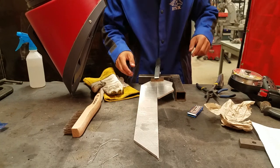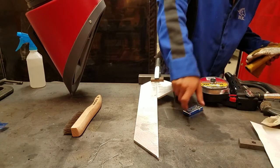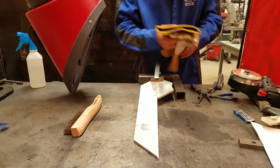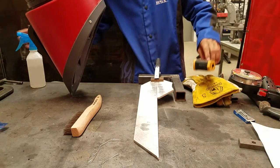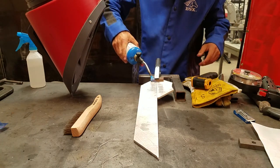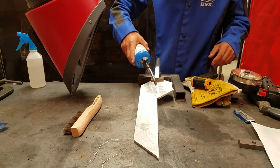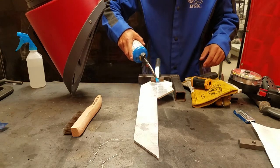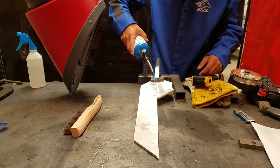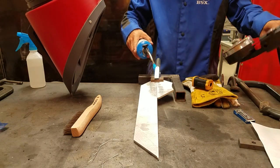It's a little awkward for me to weld. Now these pieces are fit up and we're going to do something we don't normally need to do for other metals: preheating. We're going to preheat it to 120, maybe 150 degrees Fahrenheit. We're just going to use a propane torch, but you could also use oxyacetylene with a rosebud tip. You only really need to do this for thicker pieces of aluminum; for thinner pieces it's not really necessary. When using the spool gun, you want to have a stick-out of about three quarters of an inch, versus more like a quarter inch when using steel.